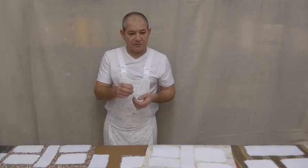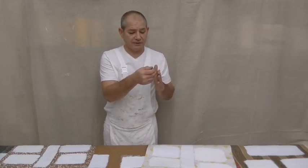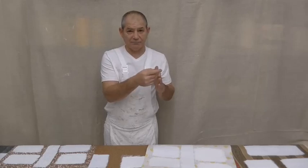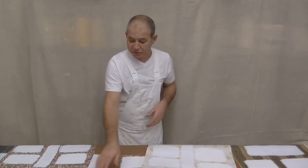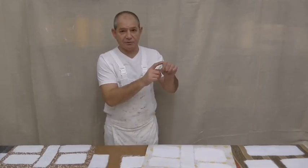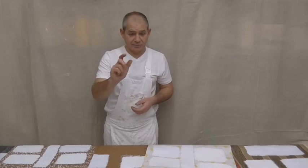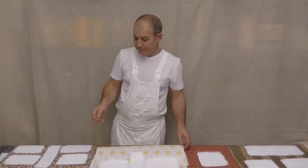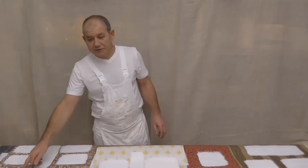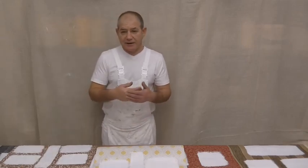You may get brown marks appearing on the wall where possibly there is a nail, a pin behind, rusting. So the paper that's on, you might not see it, but as soon as you put some paint over it, you could get a brown spot. So tin of spray at that point, let it all dry, tin of spray. A good tip, if you are painting over the paper, especially in kitchens, is to wipe down the paper first. Just allow your paint to sit better.